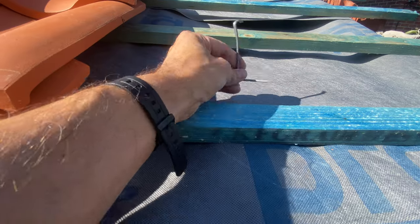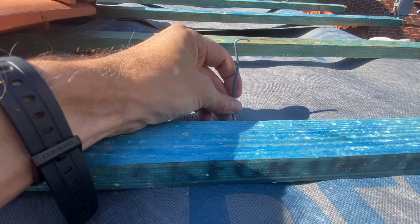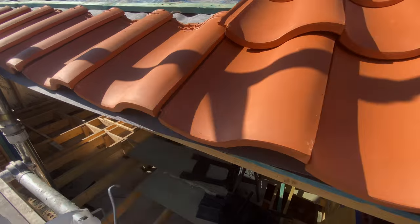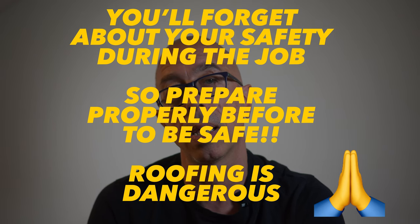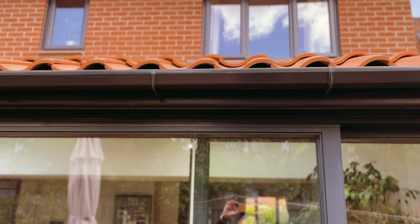By the time I was on site I knew exactly what was going where. With the plastic accessories in place, it's time to fix the tiles, and these use an idiot-proof mechanical fixing system which goes into the top of the battens. The tiles have an interlocking edge, so the combination of the interlocking junction and the mechanical fixing gives us the required double fixing laid out in the British Standards. For the edges, to maintain the double fixing requirement where there's no tile to interlock to, we use an additional fixing which will be part of your system. There's also the issue of working at height — preparing a safe working plan for you and your colleagues, which for a single-storey home extension is not a particularly complex thing to do. It's definitely not a big deal to hire a scaffold or platform for a small project such as this.